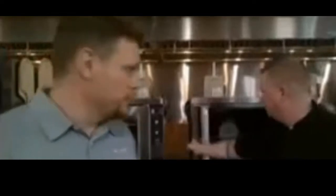So we can turn the oven off and back on. This is going to reset the ignition module and try for ignition again. And the second thing we can do is open and close the doors. By opening the doors, feeling on the inside if it's hot or not. Dan, is it hot? It's not hot. We can close the doors and have it try to heat again. Opening and closing the doors will reset the ignition module once it goes into lockout internally.